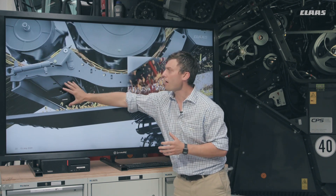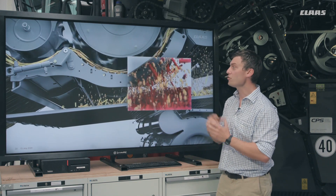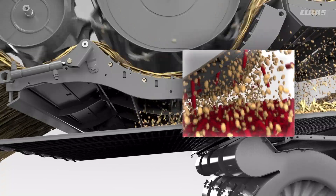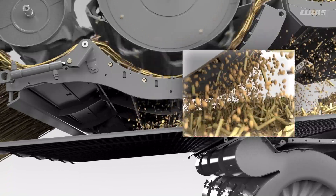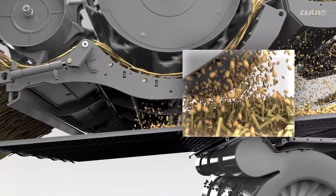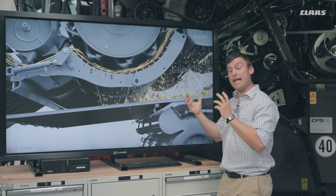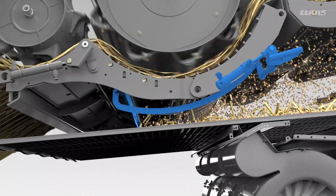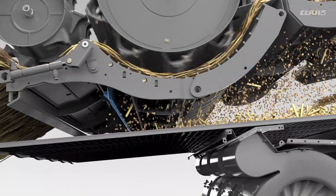At the front, the yellow part — that's the deawning plates. Adapting for different conditions and really fine-tuning the machine, we have a second deawning plate on the main concave itself. The new concave flap can be operated hydraulically in and out, adapting for those changing conditions so we can control the amount of area in and out from the cabin.